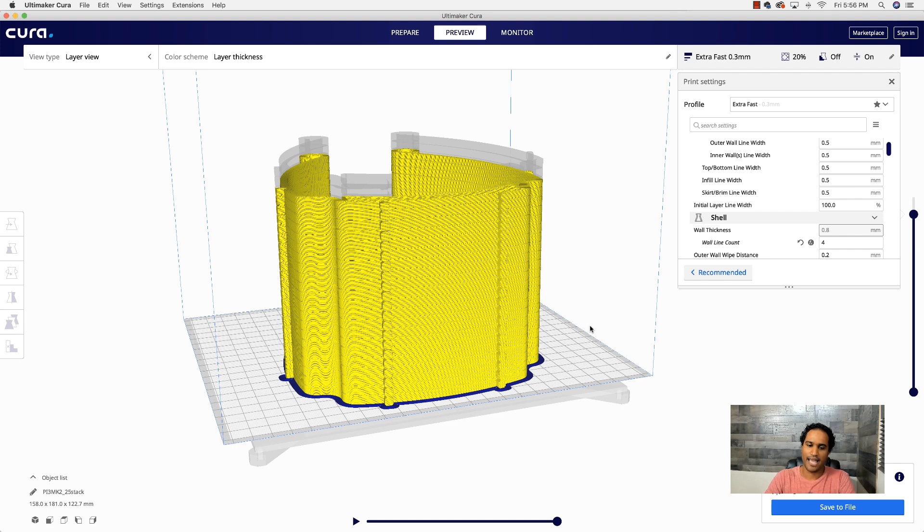Just a quick video to show you how to take advantage of this principle — you can do it with any model, though you do have to be careful about bridging. I find this a very powerful technique, especially having the option to bring an STL into Fusion 360, tweak it, and re-export it with the gap you need. I recommend testing first: print just two models stacked with a 0.35 mm gap and see if you can break them apart. Use a flathead screwdriver or putty knife — stay away from a razor or box cutter in case it slips. If it doesn't work, increment or decrease the gap by 0.05 mm increments until you get it right. Once you have it, you can stack as high as you want. Leave questions in the comments, give it a like, and subscribe for more content.